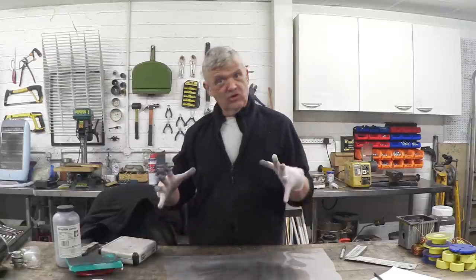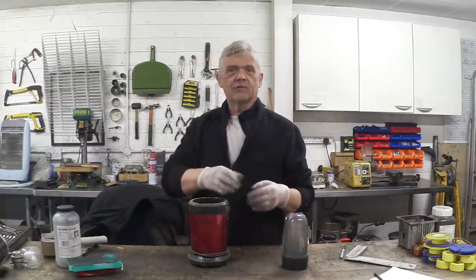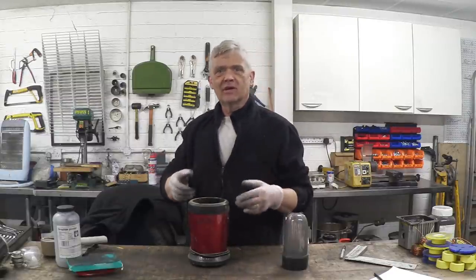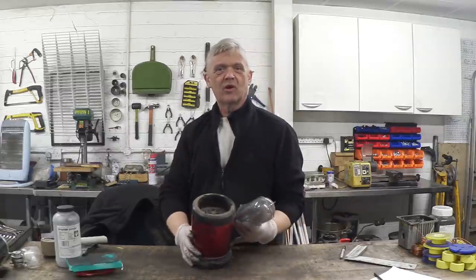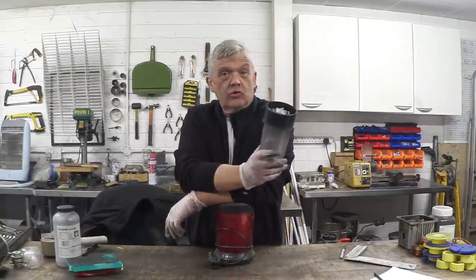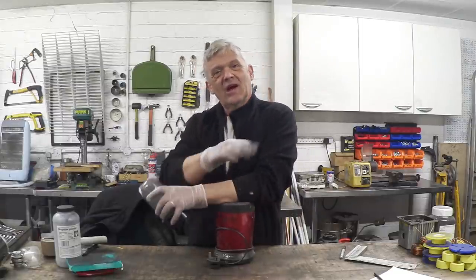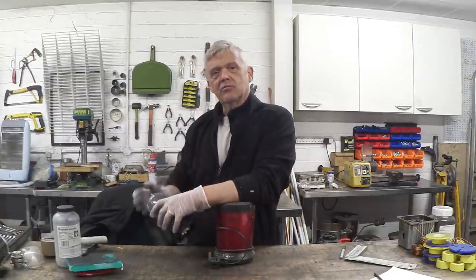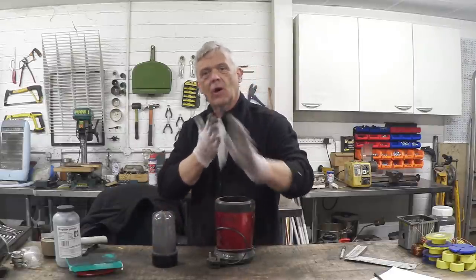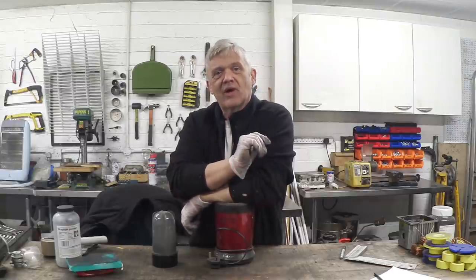You might want a big tub of graphene to apply in things like concrete. It's the Irish who took it one step further — courtesy of Trinity College Dublin. They took the idea of shearing and rather than doing it manually with sticky tape or sandpaper, they used a household blender. They filled it with a mixture of alcohol, water, and washing up liquid, added some graphite, and ran it for absolutely ages. Everything whizzing around sheared the flakes off, and after a couple of hours they got graphene in solution.